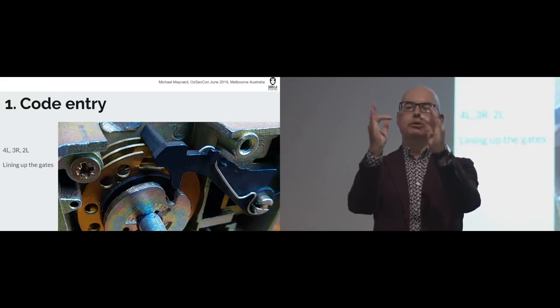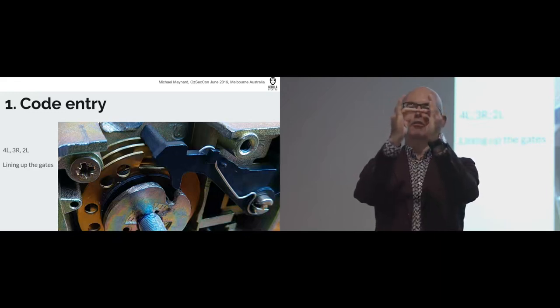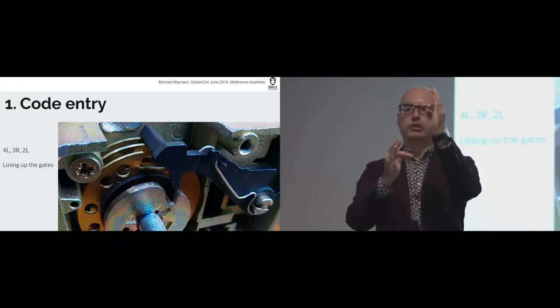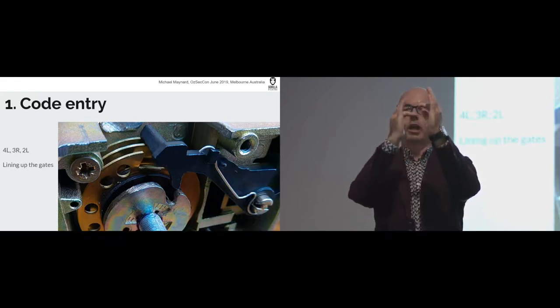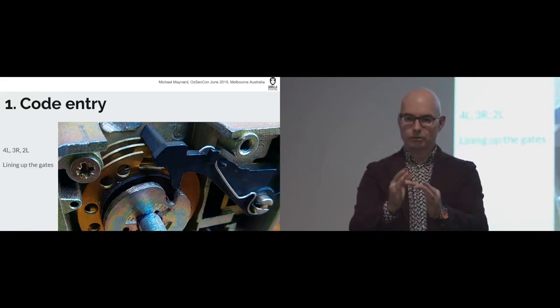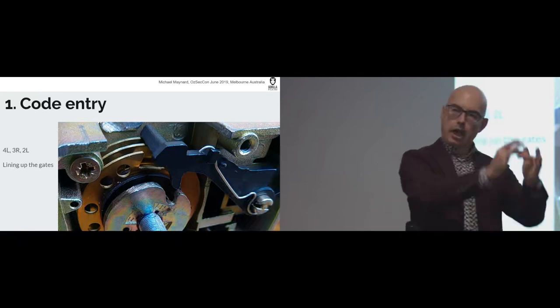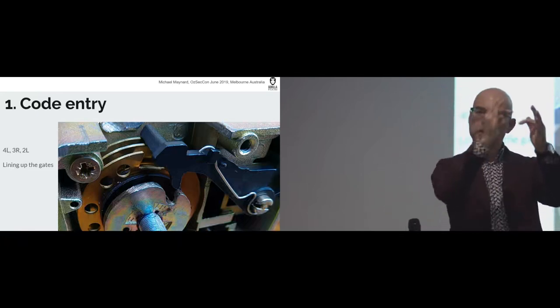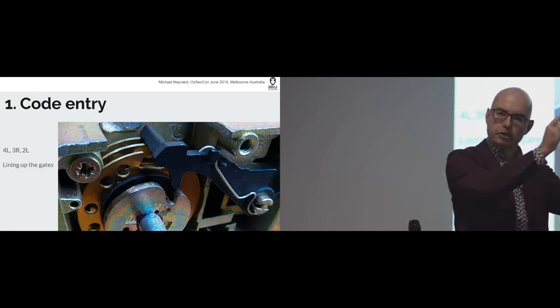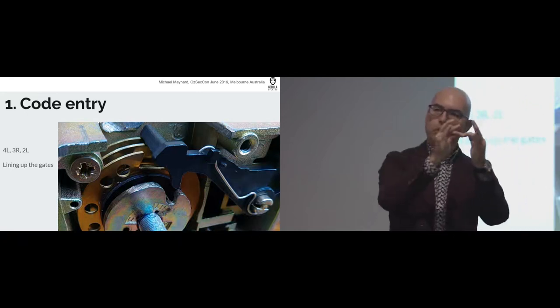Here's our next wheel, okay, and let's use that finger. It's sticking out like that. So, here's our first rotation. Just the drive cam rotates, then it comes round and starts rotating that wheel. Then that goes round and it picks up the next one and the next one. So there's our four rotations. So once we've rotated this four times, we've picked up all of those wheels.